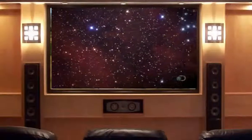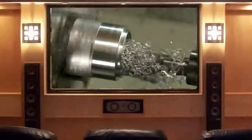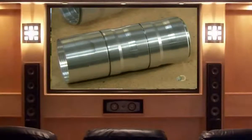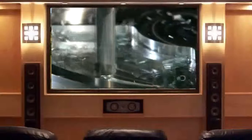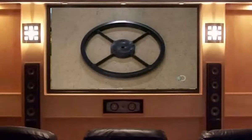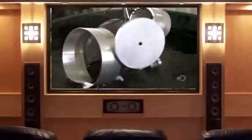A reflecting telescope bounces and concentrates light with mirrors. Production begins with the machining of cylindrical metal parts called baffles — when screwed together, they'll block stray light, which would interfere with the telescope's operation. More tools transform a solid aluminum disc into a ring with spokes. This part, called the spider, is a framework for supporting the telescope's secondary mirror. After coating the metal parts with a protective oxide, they plunge them into a vat of black dye. The dye soaks into the oxidized pores and seals the surface of the parts.